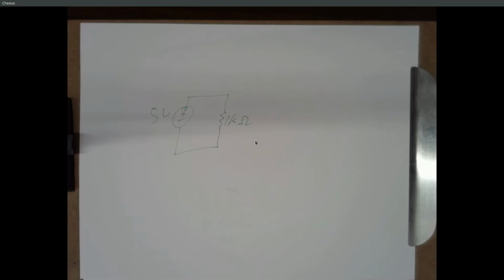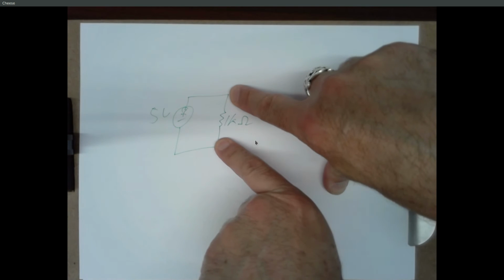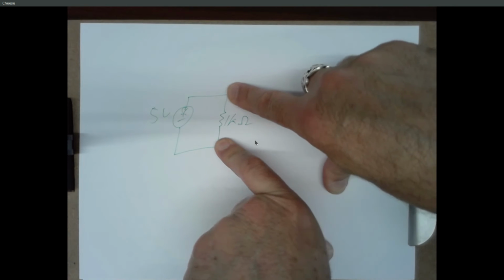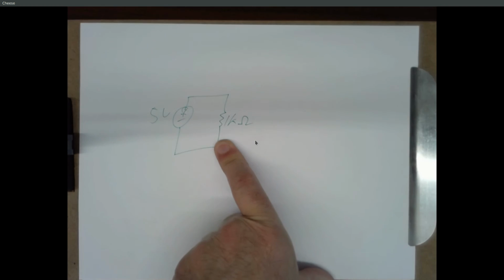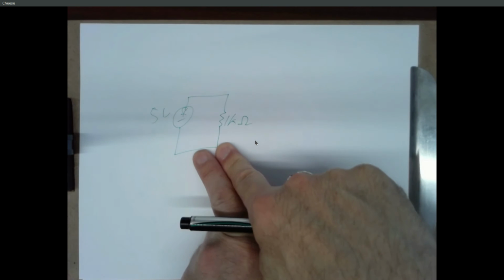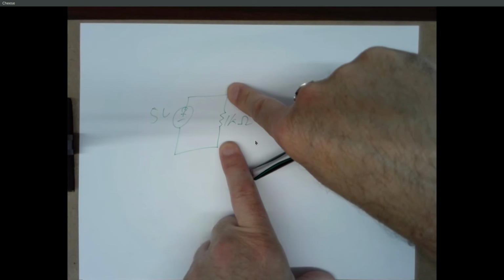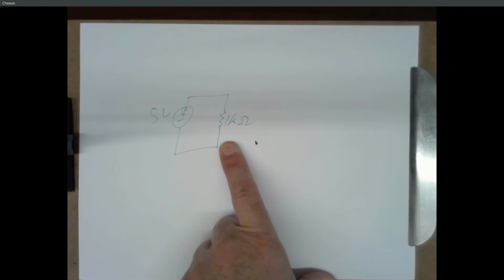So you take your multimeter, and you put a red probe here, black probe here, you put it on voltage setting, and you measure the voltage. And it should say 5 volts, right? Okay, and then, so that goes in your lab. We built the circuit, there's a picture of the circuit. We measured the voltage across this resistor with a multimeter. The voltage we measured was 4.92 volts.